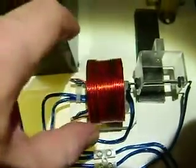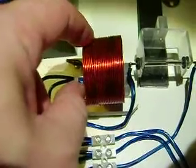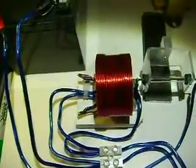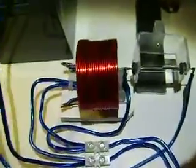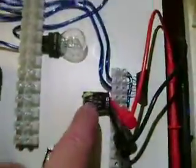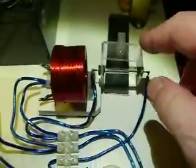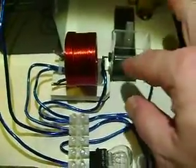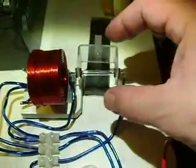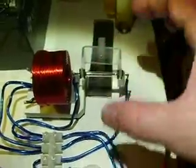This coil I haven't measured yet. I know there's a process to do it, I just really haven't done it yet. But from what I can calculate off of an inductor calculator, it's around 2 millihenries, 0.4 ohms — I think it's 18 gauge wire. The meter is showing 2 volts on this cap. We have this set up so that when I bring a magnet onto this side of the reed and it closes, it sends current to here, and then this sends a countering same pole which makes the reed open again, and then it oscillates.